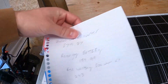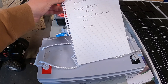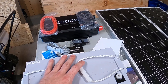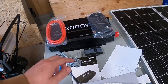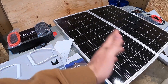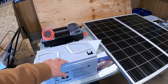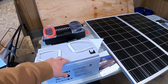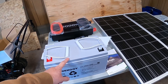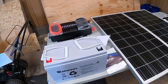The grand total to run a system of this size is $712.86. There are a couple of other small things you'll need to buy, including fuses to keep the system safe, and some hardware like screws to mount the inverter to the walls. Basically, I wanted to show what you could get for under a thousand dollars. A system like this will run a bunch of small things — pretty much anything you can plug into your wall — but you're not going to want to run hair dryers or heaters. With one battery, you'd drain the system so quickly that I wouldn't recommend doing that.